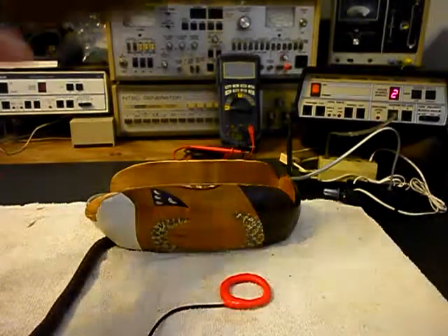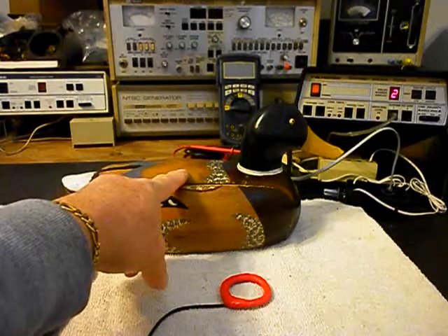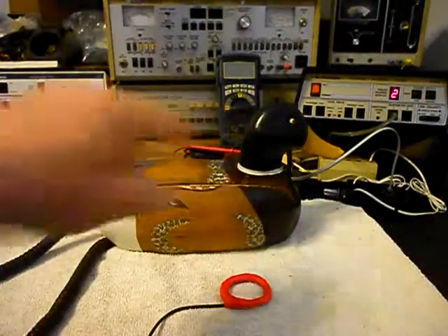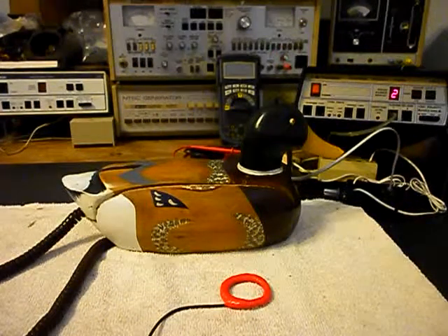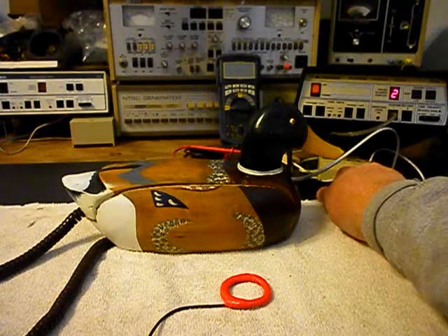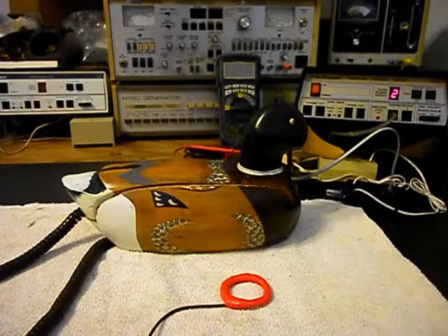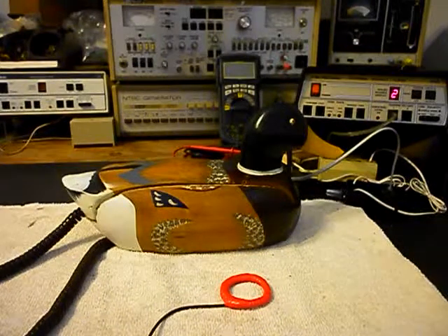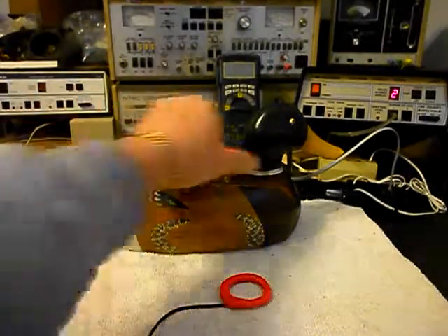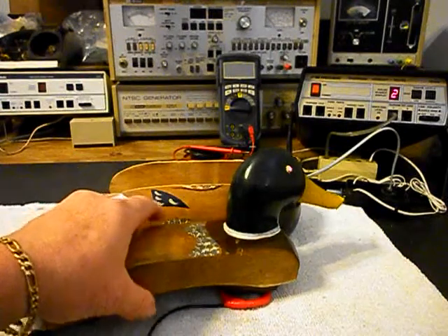Hello, hello. So now that we know this duck is quacking on a ring cycle, it's dialing out, it has transmit and receive, and the eyes are lighting when the duck is off hook and on a ring cycle — we want to go ahead and push this button on the switch box. That gives us a line out, totally takes the analyzer out of the situation, and we can call a time and temp number. We'll turn our amplifier on and give you some dial tone and make that call.